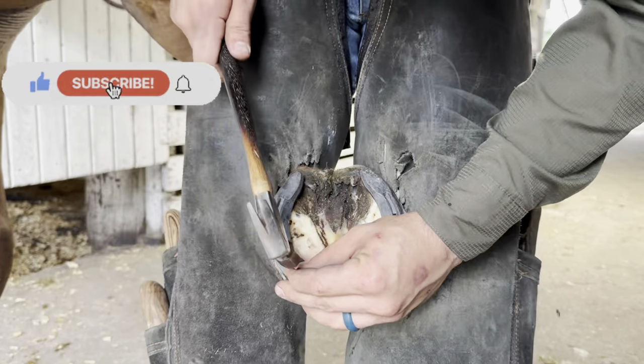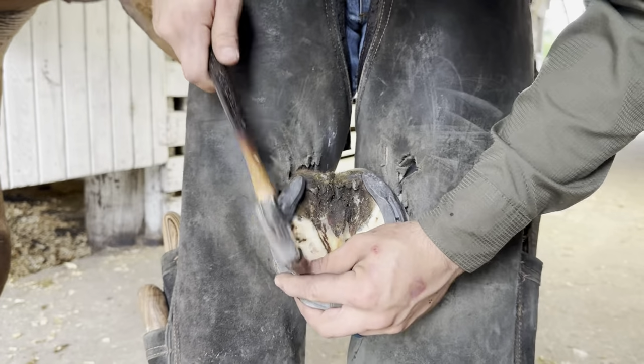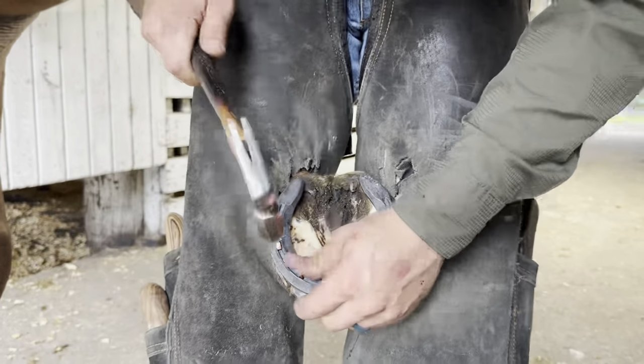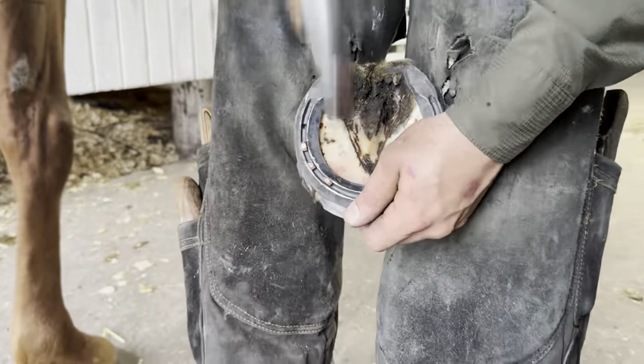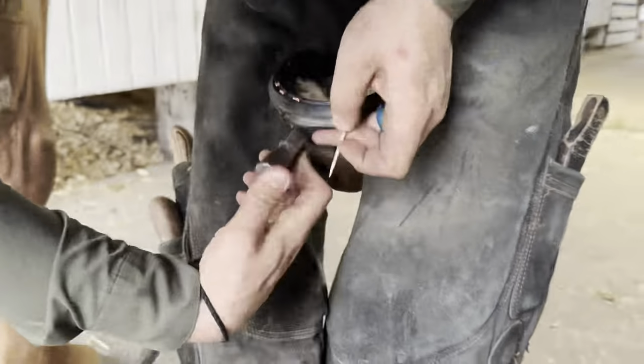When we put sliding plates on a reining horse or reining cow horse or even some heel and calf horses, we grind the nail heads off with our rasp, because the whole point of the sliders is no traction. You want it as slick as possible.